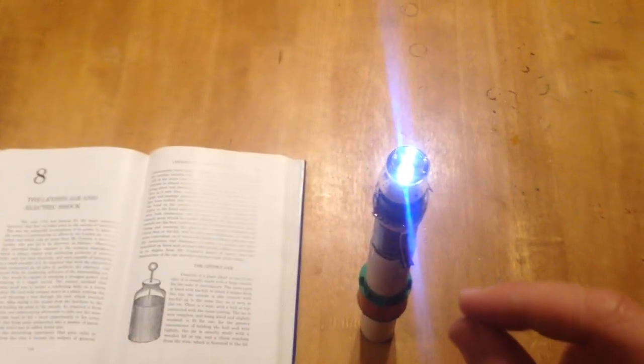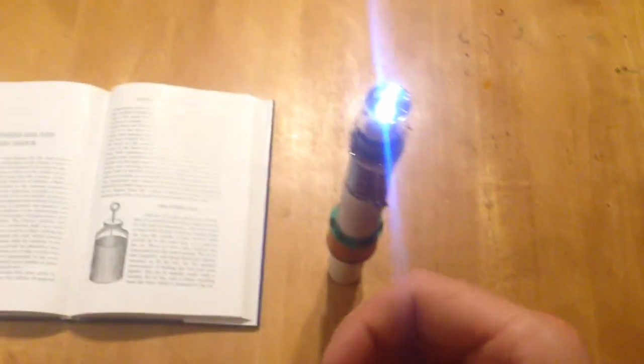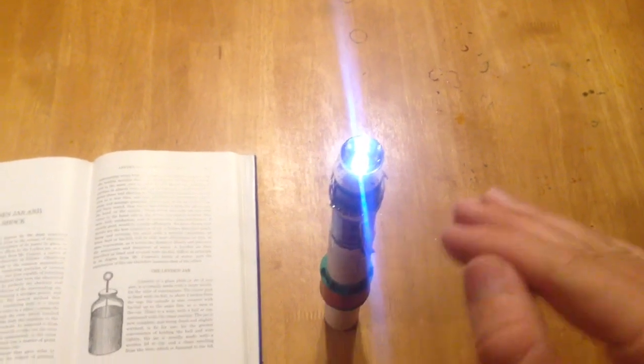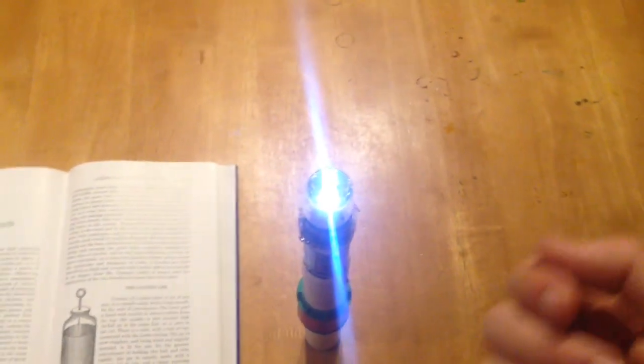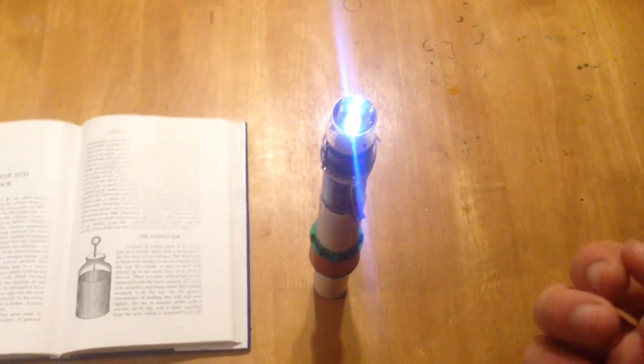I did a long test with a 150 volt, 13,000 microfarad capacitor — a really old big can capacitor. I put it at 70 volts, got the circuit running driving three LEDs you could read by, then disconnected the power supply and left it overnight. I came back the next morning and it was down to about 63 volts after sitting all night.